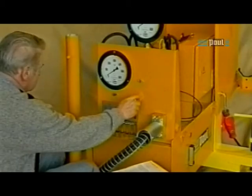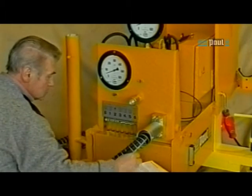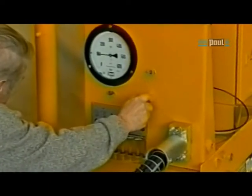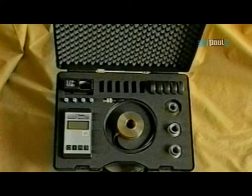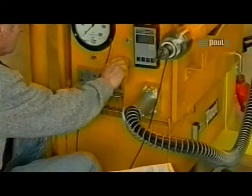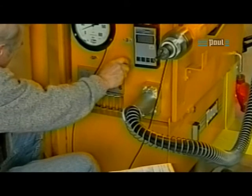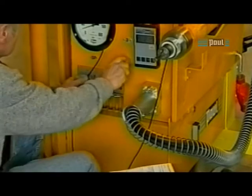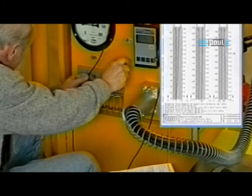The necessary stressing force is produced by means of the pre-stressing machine, consisting of a stressing jack and a hydraulic pump unit. The stressing force must be accurately reproducible and measured, so a six-monthly inspection of the pre-stressing machine is stipulated. First, a comparison is carried out between the tensioning manometer and the control manometer using a calibrated measuring device consisting of a force transducer and a display unit. Three series of measurements are made at different piston settings, with loading in 50 bar steps. At each step, the manometer reading in bar and the force measurement in kilonewtons are noted. After results are evaluated, a test certificate is issued, and a stressing force diagram is drawn. The oil pressure is then set according to these values.